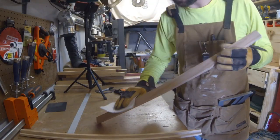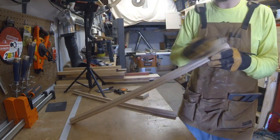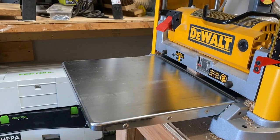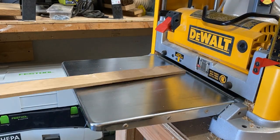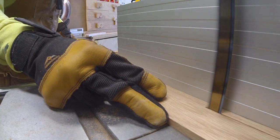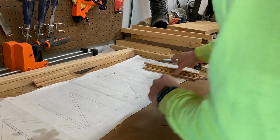With the profile cut out, I'll go over it with 100–120 grit sandpaper to round those edges off so they're not too sharp and get them nice and smooth. Now we're taking the oak that will be the truss pieces and planing it down so it's nice and flat — that's a re-sawn piece from the bandsaw. We'll cut it down to a quarter of an inch thick and then chop those down to the seven and a half inches we need.